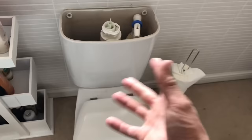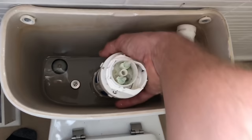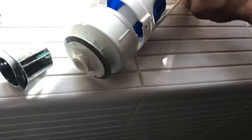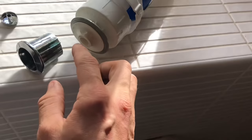Quick toilet repair — rocker system. You know it's a rocker because it's normally printed on there. This one's letting water by, so grab it and give it a twist to get it out. Before washing it, have a look — the seal is slightly curved and there's a bit of scum on it. Because I haven't got a replacement on the van, I'm going to take this off, flip it upside down, and put it back together. That way the curve will be the opposite way and hopefully it'll seal. You can see now the curve is going down instead of up, so we'll put that back in.